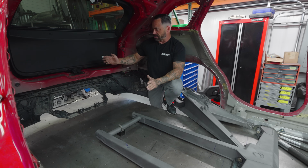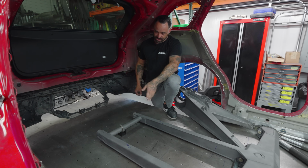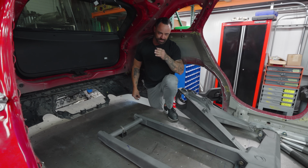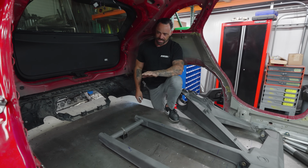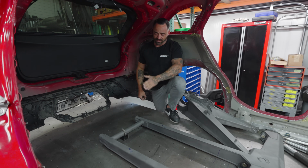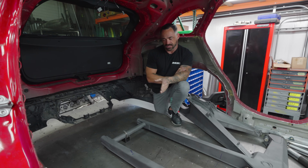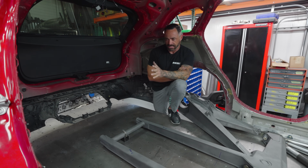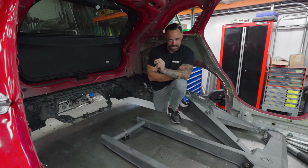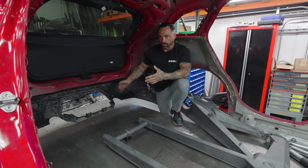We took the general measurement. The engine completely fits in here. The axles are where they want to be, and when this thing droops out, the axles and the CVs go forward, and that's the recipe for where the center line wants to be on where they come out of the gearbox. So we're not going to plant that precisely yet. We just needed to get it enough where we knew we had room, and then we'll dial that in.